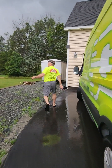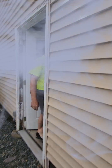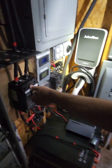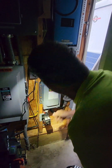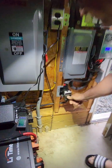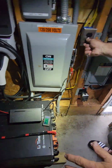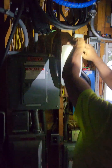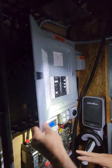Follow me. This is why you do a system like this — this is how simple it is. I'm going to turn on my inverter. I'm going to turn off my photo array and turn off the battery that feeds this charge controller, because it's already charged up. I'm in an emergency off-grid situation, so I can turn off my arrays. Now my inverter is on.